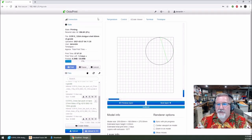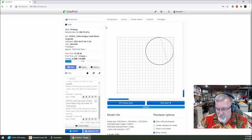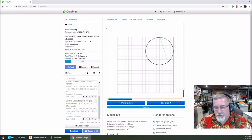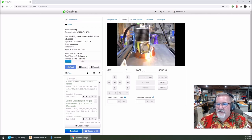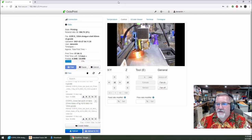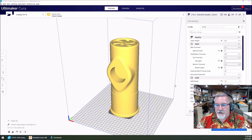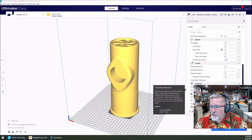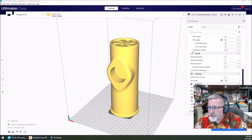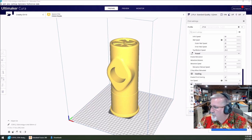If you don't have your setup with Octoprint tied to your computer, there are videos on my channel showing how to hook up a Raspberry Pi to your printer and computer. I'm using a tri hexagon infill pattern, no support, and no build plate adhesion. I'm using a Wham Bam system that's been scuffed with 220-grit wet-dry sandpaper and thoroughly cleaned with 91% isopropyl alcohol — it holds like a vice and when cooled, you just bend the flexible plate slightly and the print pops right off.